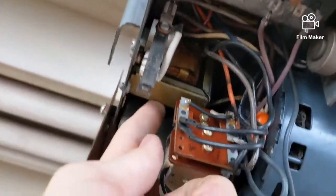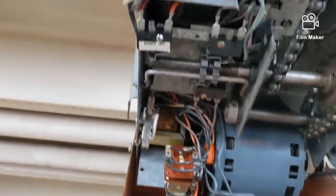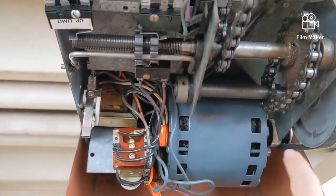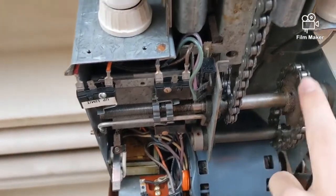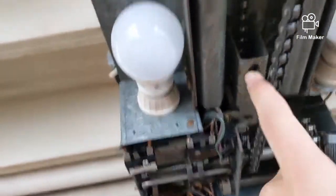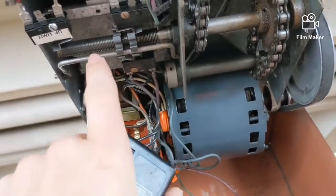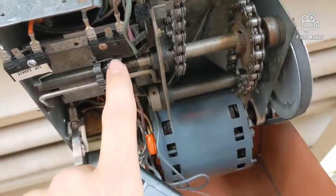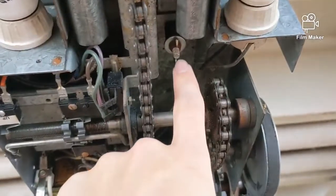There's your transformer right there. This is the R80Z. You've got your motor coming off — it's a v-belt drive — goes on to this shaft right here. The chain goes onto your main drive chain, and your limit assembly comes off this shaft right here. There's your up limit, there's your down limit.